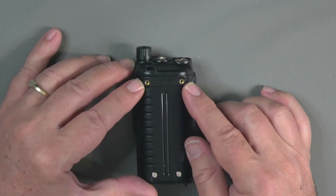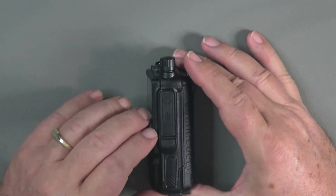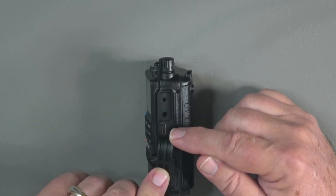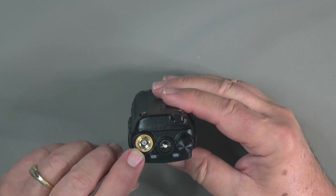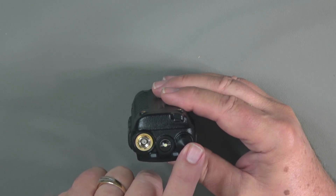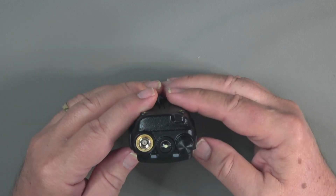We've got the battery across the back. Here are the sockets for the belt clip screws — because the radio is so small, the belt clip goes into the battery. There's a cover that covers three things: the usual K connector with speaker and microphone inputs, and the USB-C port which you can use for programming. On top of the radio is the antenna connector with the plug side, an LED flashlight, and the on/off and volume switch. There are also two LEDs that flash when transmitting or receiving, and those LEDs will flash in the breathe mode as well.